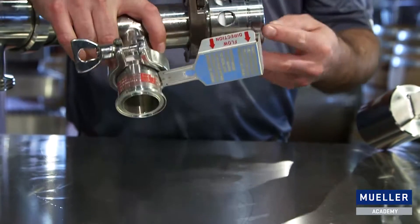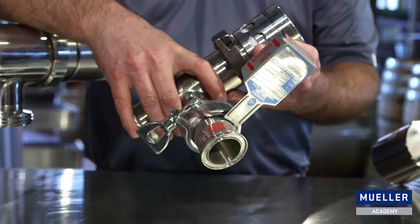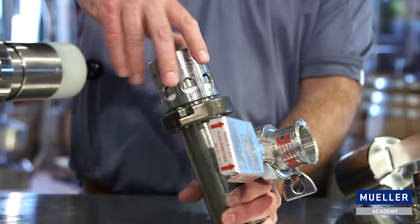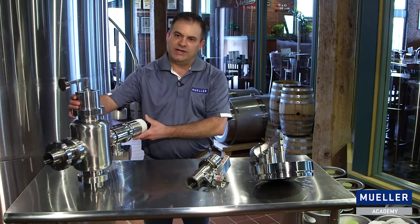The first type of valve is a small combination pressure spring-loaded vacuum relief valve. This type of valve is used on smaller tanks up to about 150 barrels. This is a reasonably low-cost valve used to protect your tank against vacuum failure. One of the disadvantages of this type of valve is that the vacuum pressure required to open the valve is rather high.